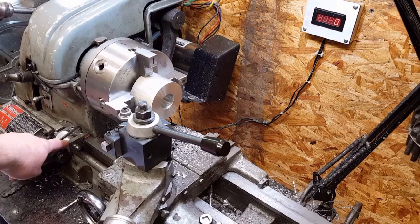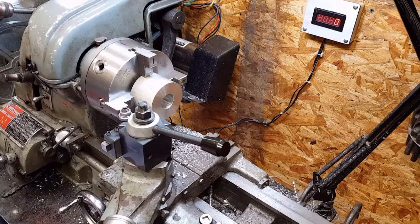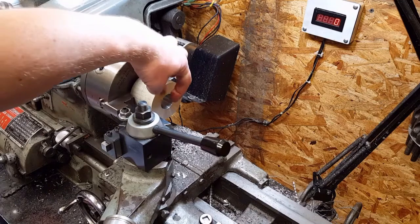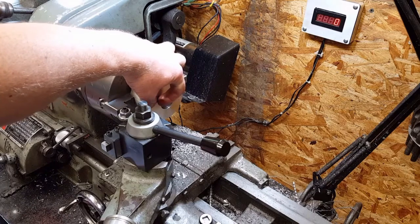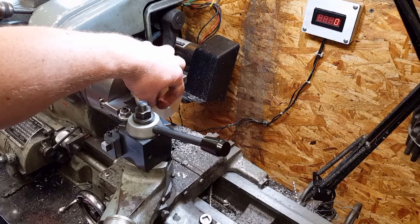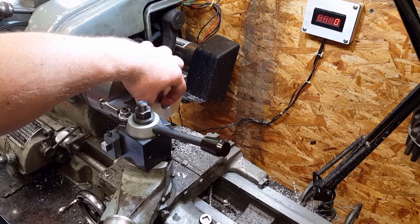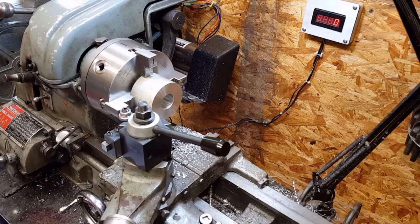Then I will set my carriage stop back here to that 400 mark, then cut down about a half an inch, because this is about 890 when it's done on one side, and I want to leave three-eighths behind. So 515 winds up being the measurement I've got to take out of it, so I'm just going to use 500 and keep the math even, in case I've got to do a little bit of a change anywhere else. Three-eighths of an inch — I could even do a little bit more just for safe keeping.